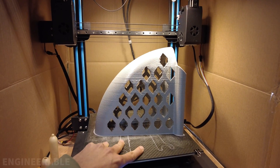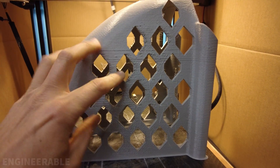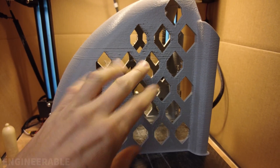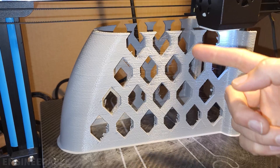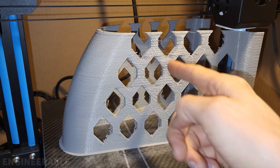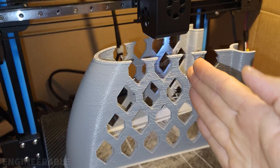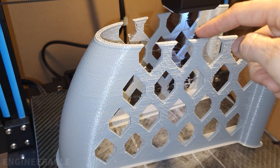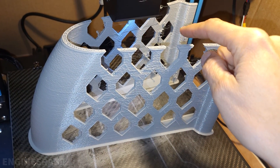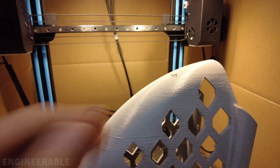It's massive on this pretty large IDEX printer. The surface finish is definitely not perfect and could be improved — there was a lot of wobble happening in these thin walls. In the future I think I would add some little reinforcement ribs behind these that would provide structure so it wouldn't move back and forth. Look at this — it's just really wiggly at the top, there's just no structure for it. I've probably made it worse by moving it, but it gets better higher up.